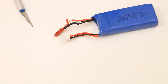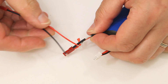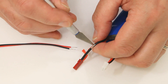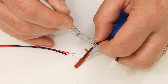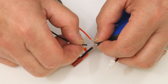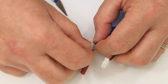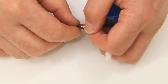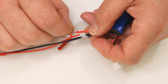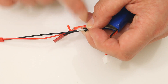There we go, that's ready for soldering. The ends of these I've prepared — I'm just going to pull the wires slightly apart to give me a little bit of a gap so I can slide that in. Just blend the wires a little bit to make it easier to solder, push that in there. You can also just literally lay it across the top and solder them together, but this wire seems quite easy to do it this way.